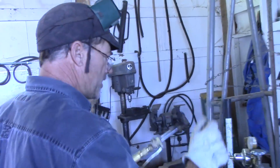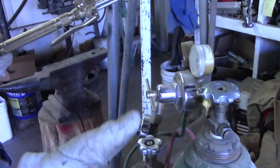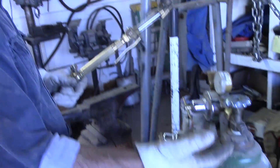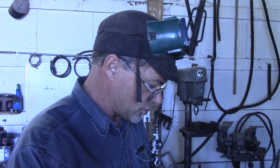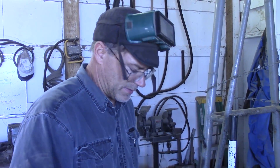Make sure you turn your valves off on your bottles. It's always a good idea because if there's a slight leak, your tank won't drain out. I always shut them off — some people leave them on, but I don't use it all the time so I shut the bottles off as well. You can also purge your lines by simply running them until the gas goes out. Some people recommend it for safety, but it's not strictly required.